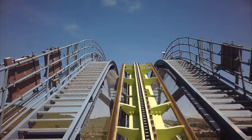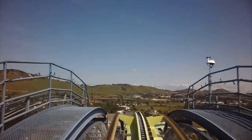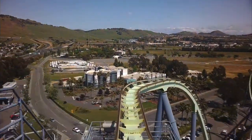Just past lift park is called lift crown. That is the crown of the lift. That's the very top. It's the top of the ride as it crowns over. Like I said earlier, that's the point that you're going to have all the wear on your chain liner. That's where everything happens up there. And then after that crown, there's pretty much nothing there. Most rides, or a lot of rides, go straight into a drop. If you're a B&M, you do that little landing right there as it levels out.